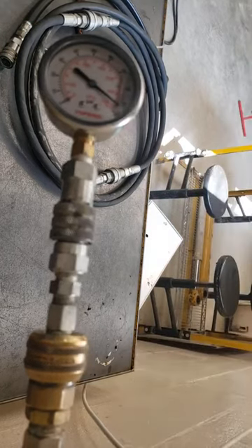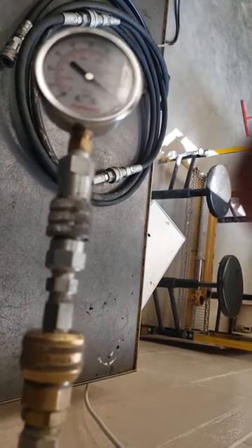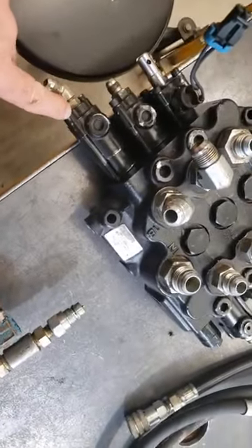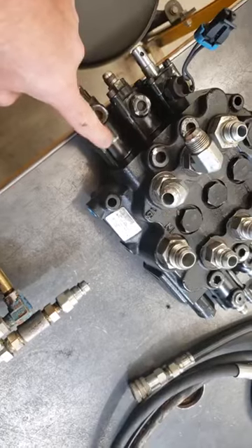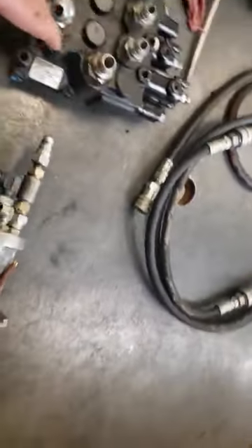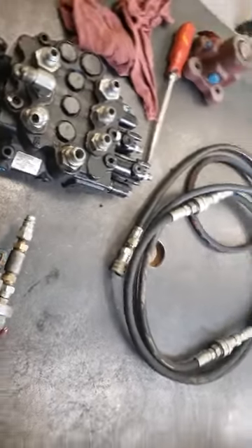As fast as I could close it, the needle shot up almost to full air pressure — almost a full 100 psi. So if I was using a valve like this to control pilot pressure flowing to a valve to operate it, I'm going to have a big problem, because when I let off the control handle I'm going to have pretty much full pilot pressure sent there, the spool's going to stay shifted.